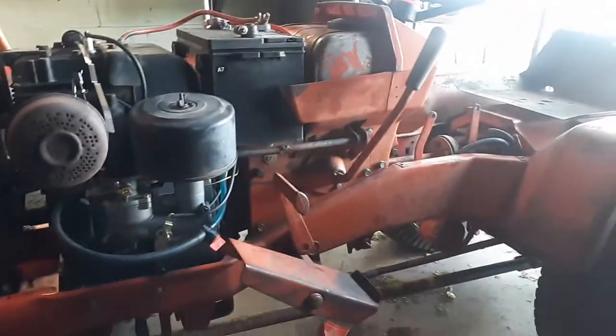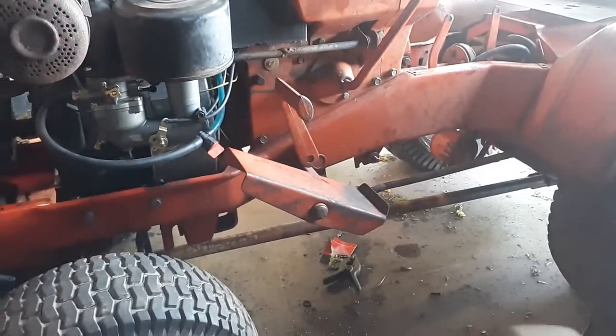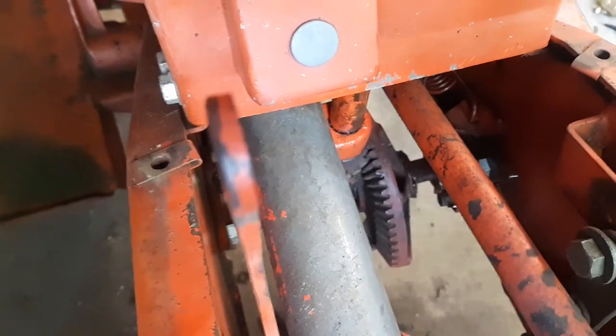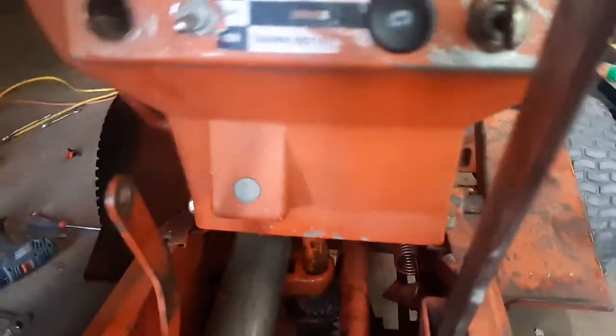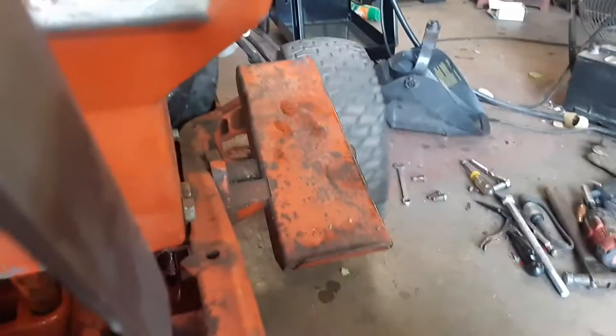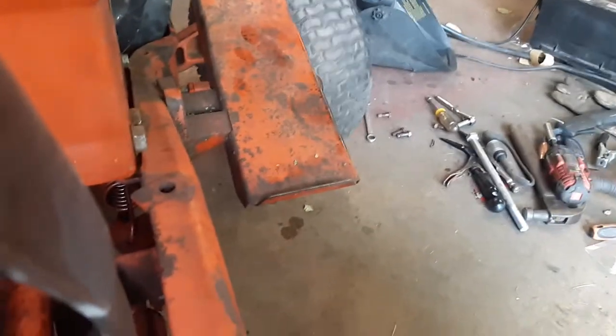Today it was kind of a chore on it. I had to take off the whole steering assembly. I had a lot of play in the steering sector down there, which I'm talking about is this one right there. It's tight now. I had problems steering. I had no steer that way, but I had some the other way, so now I have equal steering to both sides.